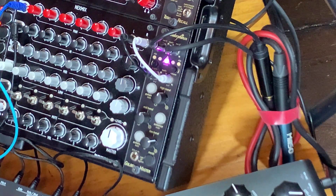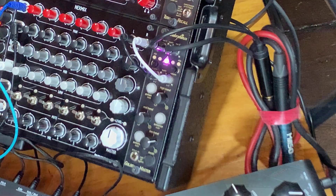The third press of the button gives you a purple light out of the LED, and that's the stereo enhancer. You have stereo enhancement controls for all three bands. Though you probably wouldn't want to stereo enhance the low end that much — it's nice to have it so you can actually decrease the stereo and make your low end more focused in the center.